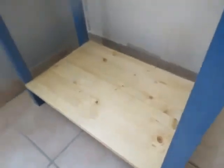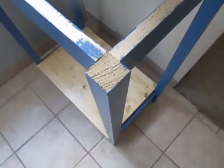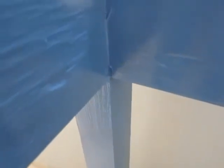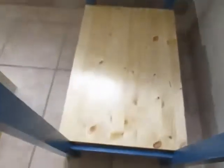You could also avoid the angle irons altogether and just make it removable. This particular table I didn't finish yet — I just wanted to show how I made it. You can see the post construction with some 1x2s, and that's all held together with pocket jigs. Instead of using the stock plugs you can purchase to cover up the holes, I just went in with some plaster putty and painted over it. The plugs don't fit that well without sanding, so it's just easier to use the putty.